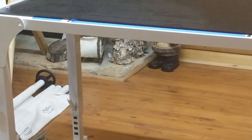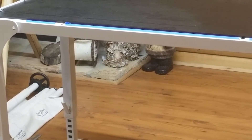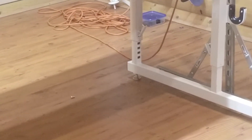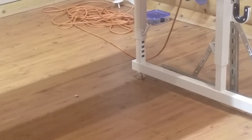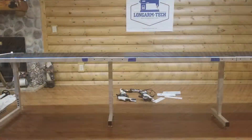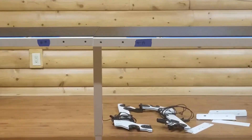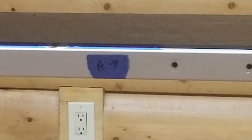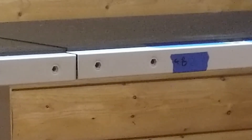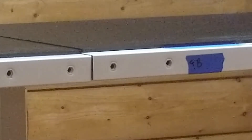One thing to check in this initial alignment is that you've got all your spring clip settings at the same level. You can see here we've got one, two, three, four slots before the spring clip — check the back, the middle, and the right side — they should all be the same. I have seen frames that even had machines on them that had one or two slots out of alignment with no possibility of getting the machine level. Also note there are blue labels on either side: if you're disassembling a frame and moving it, match the sides up — joint A to joint A, joint B to joint B — so your frame sections that were perfectly aligned can be reassembled correctly.